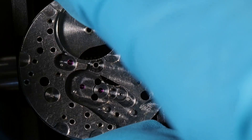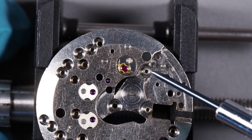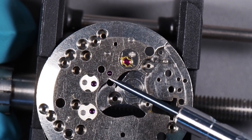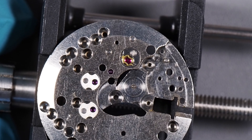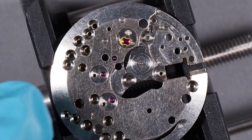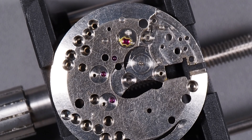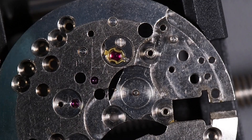There are three more things that need to be removed from the base plate. Turning the base plate over, we can see another Inca block set — the lower jewels for the balance — and then for the escape wheel and the pallet fork, they have lower cap jewels that have to be taken off, each held on by a single screw. I spoke incorrectly though — one of these cap jewels is for the escape wheel and one is for the third wheel. The pallet fork doesn't have a lower cap jewel. I'm not sure why they used a cap jewel system on the third wheel for this movement, but the AS 1187 does, and I've worked on several of these movements and it's always perplexed me.